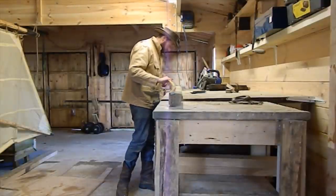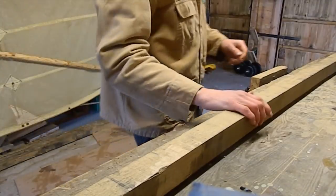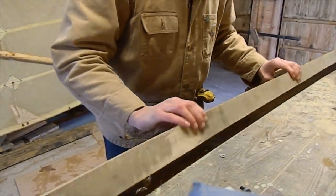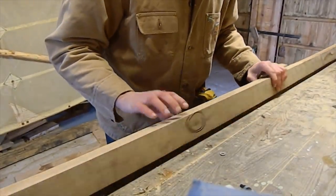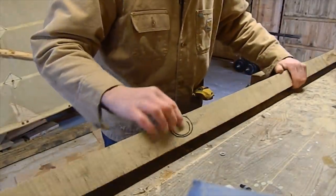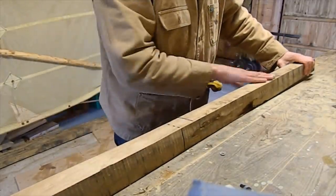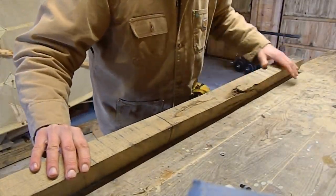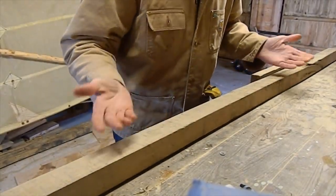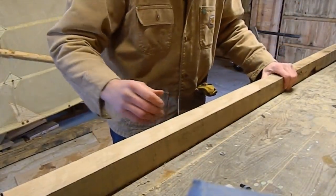In this case we're not going to get quite two metres. Upon slightly closer inspection, looking for knots, we've got a couple — this one's obviously slightly larger, we've got this small one cutting through and coming out over here. And obviously as we already knew, there's a fair bit of knotting up this end, so we've not got a lot left in this beam. We've got around about 60 inches, so that's roughly 150cm.